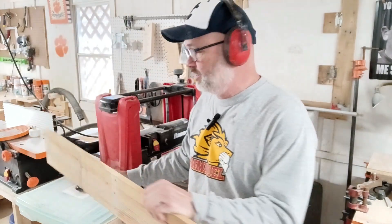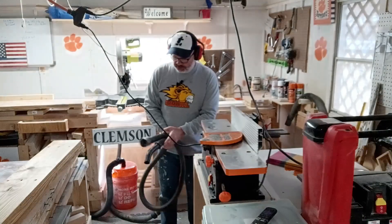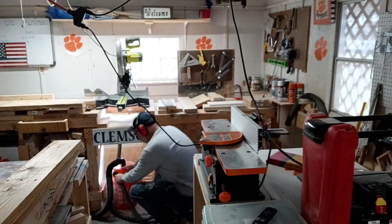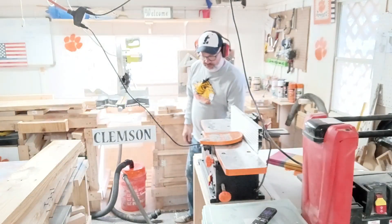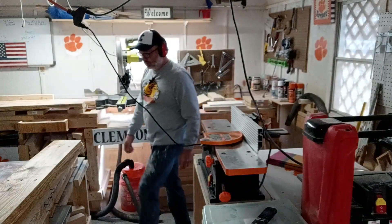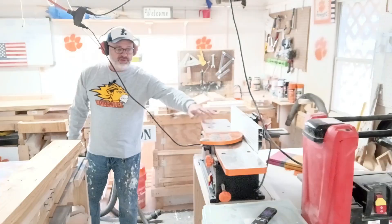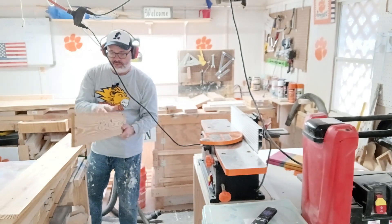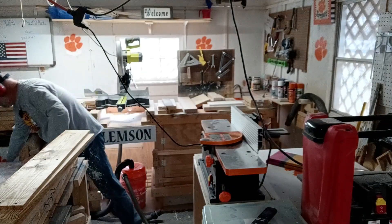I'll be ready to put them on the joiner over here and joint the sides of them. Getting ready to use my joiner now. I need to hook the dust collection system up — I need to get some kind of better setup than this. This is my dust collection bucket down here, a dust topper from Home Depot, hooked into my shop vac. The pipes are universal and run into different things, but I just have to unhook and hook them again. I'm fixing to do the joining on the boards I just planed. Both sides came out pretty smooth — looks like good wood. I'm going to joint this now so when I join them together they'll come out even and butt together real good.